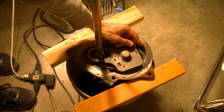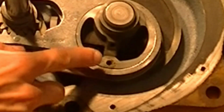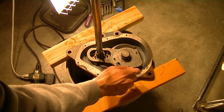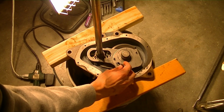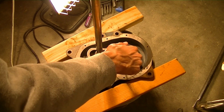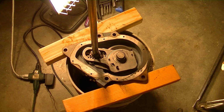So this sits on the connecting gear like that, and there's a hole right here which lines up with, if you can see, the hole right here on this moon gear where that goes, and then the set screw. So this set screw sets in like that, and you'll screw it down, and use the long end of the wrench to get it most of the way in. Go ahead and put the rest of the neutral drain parts in.